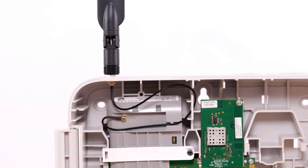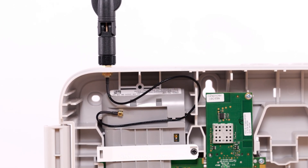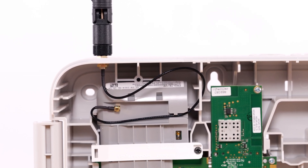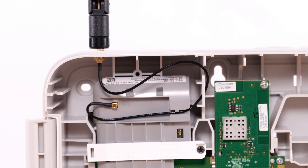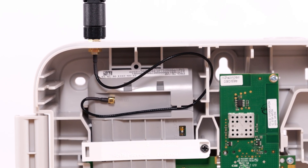If you need to install the Pro LTE-A antenna, you will do so by connecting it to the connector on the top left of the LTE module. Once you have the antenna connected, change the DIP switch to EXT. This enables the LTE module to use the external antenna.